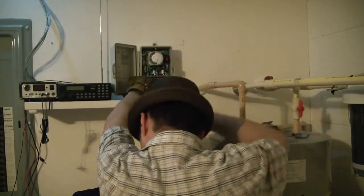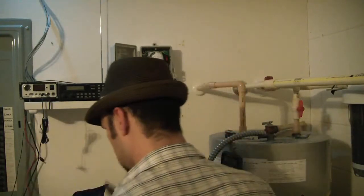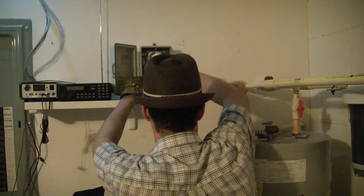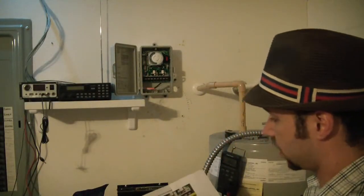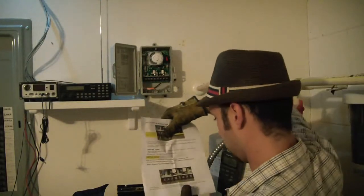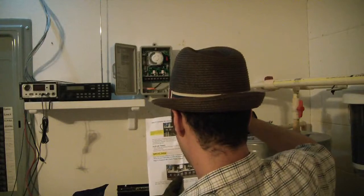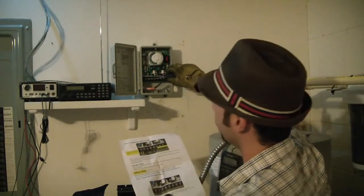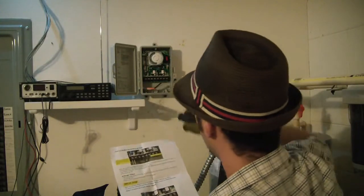It's amazing how long the hot water heater actually holds hot water in the tank. Being it's insulated, you really do get a couple hours before it starts to cool off. So I'm guessing probably a lot of saved electricity on this project. This is where the directions come in nice and handy. Yours might not be exactly the same as mine, but it does have some nice color graphics on how to set this up. There are some dip switches that actually have to be turned for 220. This one will work on 110 as well, so it's got a couple different settings. Dip switch number two needs to be turned on and the rest stay off. The first two here are for the timer — it needs the hot to 1 and 2, and that's going to turn on the timer. Then there are some jumpers that go across to your common and your neutral.